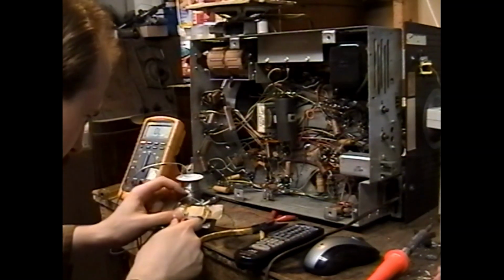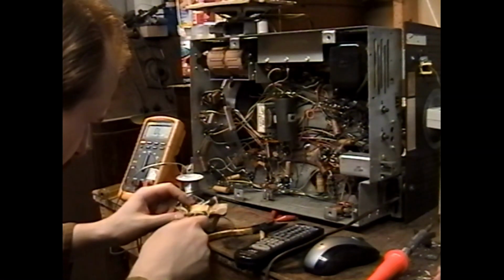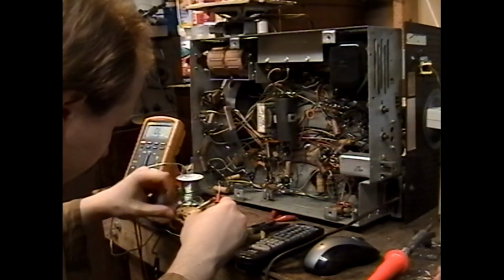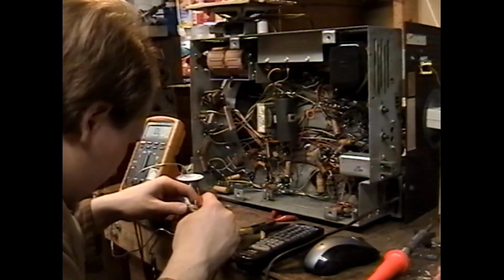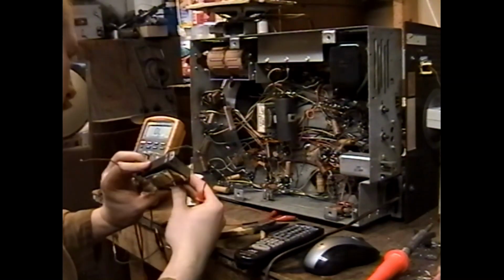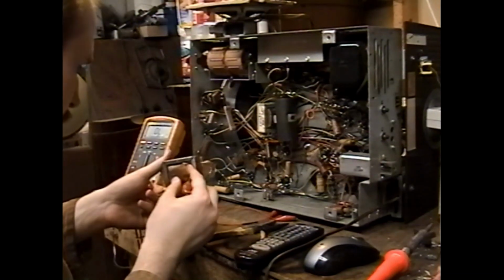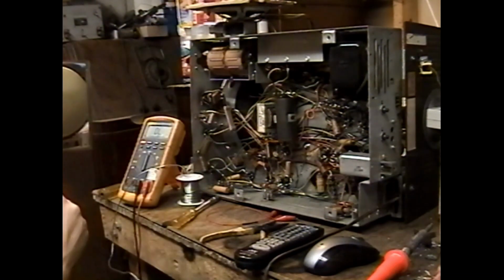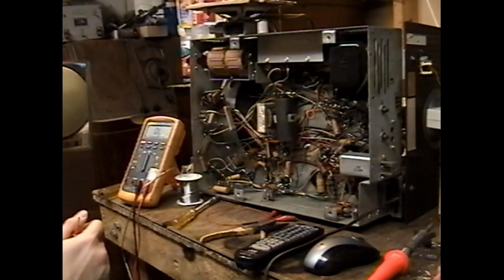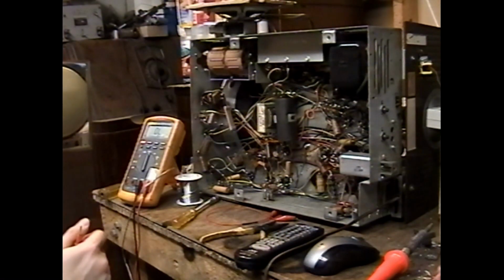Man, just no dice. Would I find anything else if I dug more into this transformer? Maybe not. Yeah, I'm just wasting my life on this, aren't I? It's not like there's any mouse chew on this. If there was mouse chew, I could point to a smoking gun. I found the ends of the winding where they connect to the coil, and the ends of the winding tell me the winding's not good internally. You know what? This transformer's round file mode. I'm done with it.